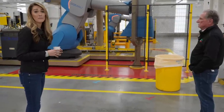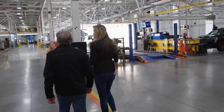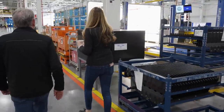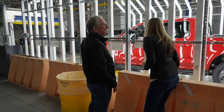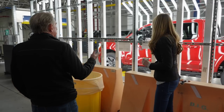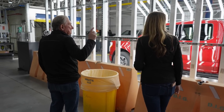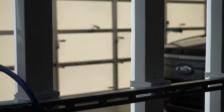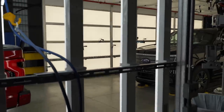So all these little pieces hanging off the side — are they sensors detecting something? They may be, but normally it's eyeballs that get the job done. Now I know what those sensors are for — they're for gaps. This is not the place I'd want to find gaps; I'd want to find that way down the line. But if they're sensing gaps here, those scanners are lasers — they'll check the gap around the car and make sure everything is right where it's supposed to be. You want to be in the micron kind of area if you can.